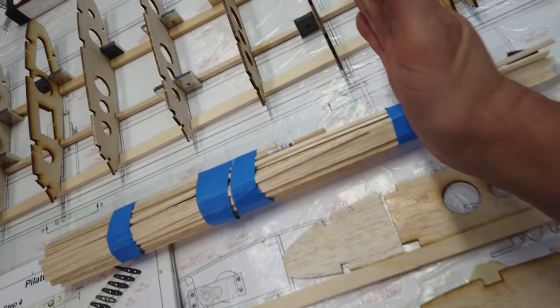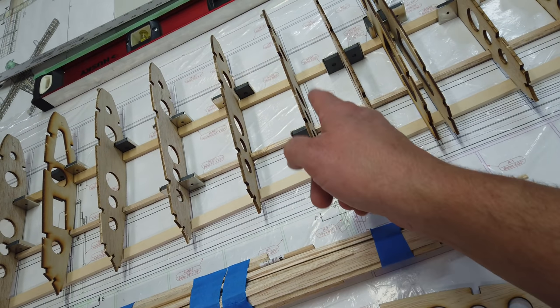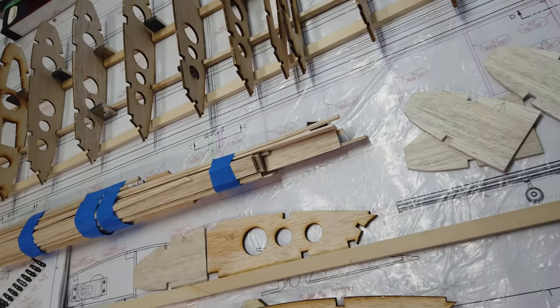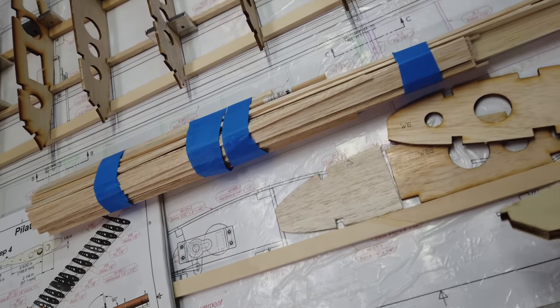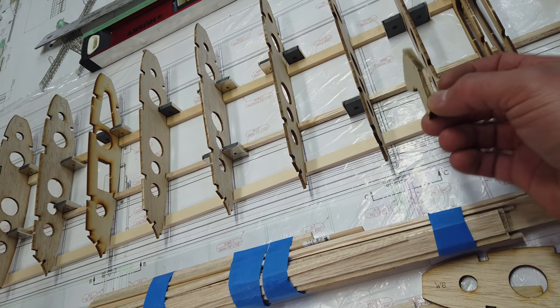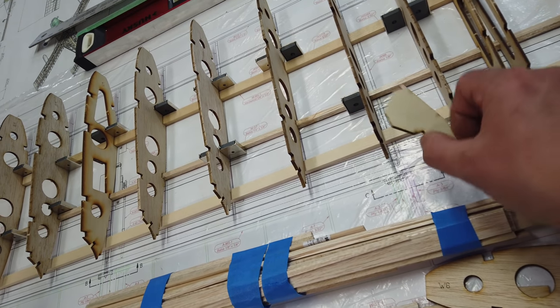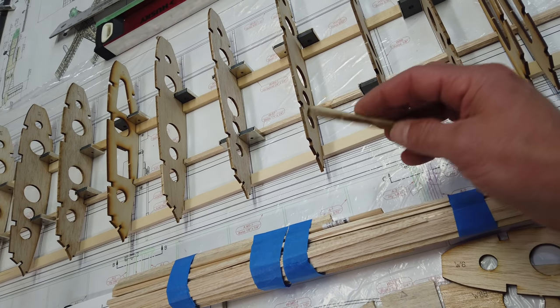Number two, we need to cut a piece of hardwood that goes in between the two ribs. So a couple options for that, but I think the easiest option, because those ribs get spaced out a quarter of an inch because the hinge actually sits inside there. So the hinge fits inside there, and the hinge happens to be a quarter of an inch. So what I'm going to make these sub ribs out of is a quarter inch ply.